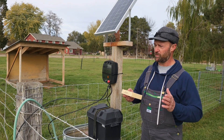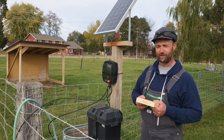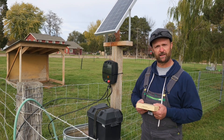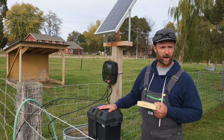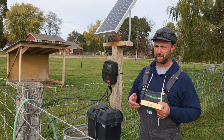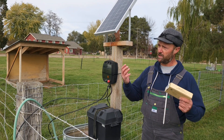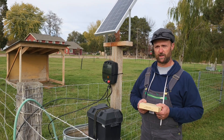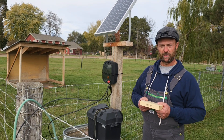It also keeps predators out. We're in coyote country and there are also domestic dogs that are hungry for those lambs, and it helps keep those predators out. So that would be the main reason you'd want to build something like this — to help protect your livestock a little bit better. You also get a lot more backup power depending on the size of battery you choose to use, and if you have a lot of cloudy days your fence isn't going to go down. The extra power also means that if you have weeds or grass growing up and touching your fence line, your fence is still going to remain powerful through a lot of that growth.